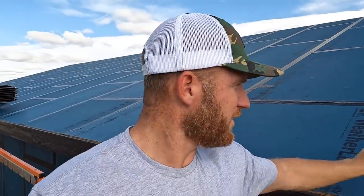Pretty muddy on site, but good news is the roof has dried out. We are going to be installing the panels on the other side that we have. We can go about 40 or so feet down this roof before we run out of panels. The rest of them are being produced at Metal Sales. There's a shortage of black 26 gauge metal, I guess. So we're gonna do what we can, get as much of this covered as we can, because we've only got another day before we turn back into another rainy weather pattern.